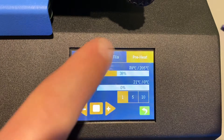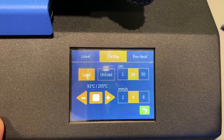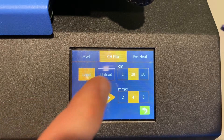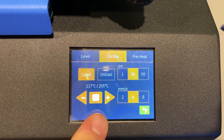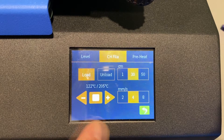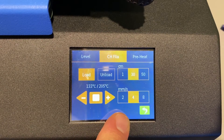So that's how it's preheating. Then if we look at Change Filament, they have a Load and an Unload. It's right now set to unload 30 centimeters or load 30 centimeters at a time. It's going to 205, just like I set on the other screen, so I could have adjusted it here, and I can also change my millimeters per second.